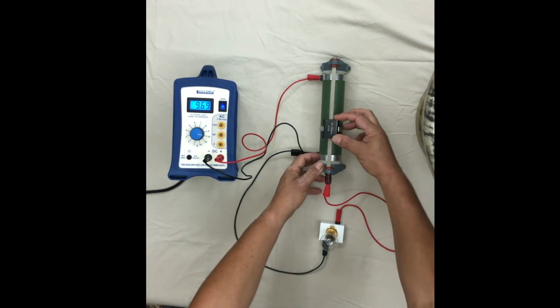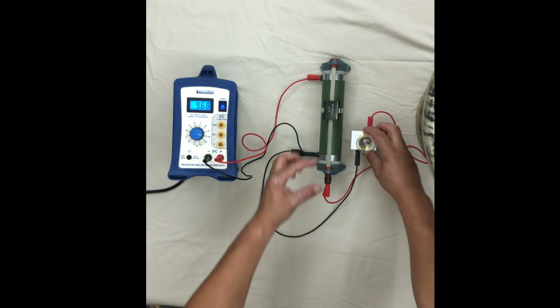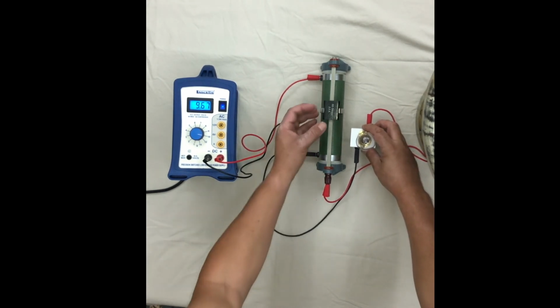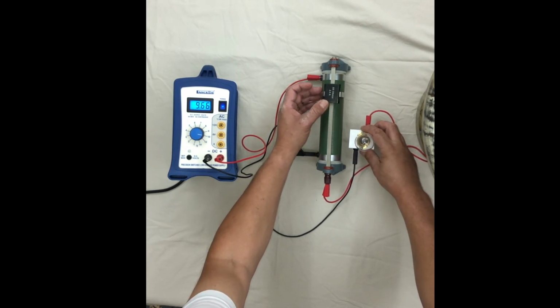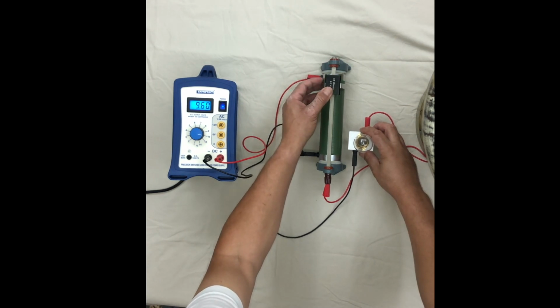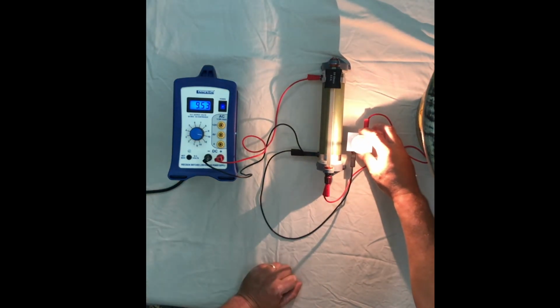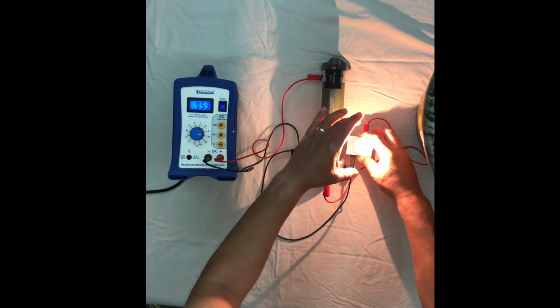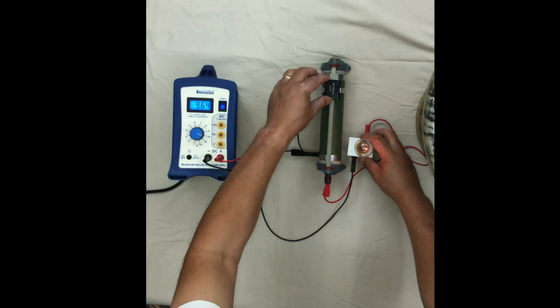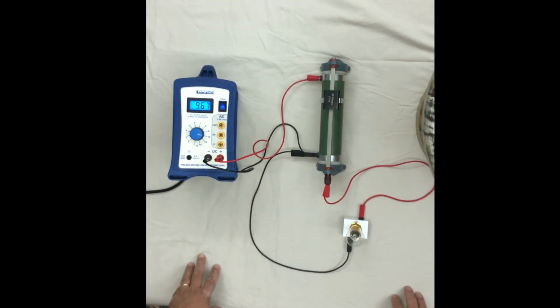Now if we take it up, okay, don't forget the bulb is in parallel with this section. As we take it up, resistance increases until the potential difference here becomes high enough to turn the bulb on. Okay? So high resistance, high potential difference, high current through the bulb. Now that is actually exactly how dimmer switches are set up. The reason I'll go into in the next video.